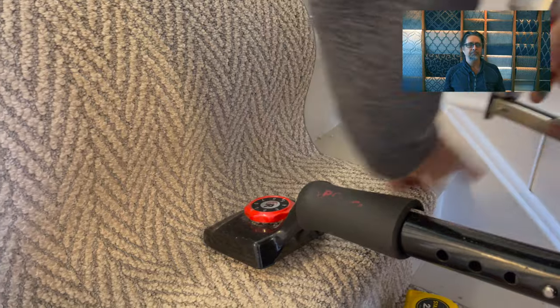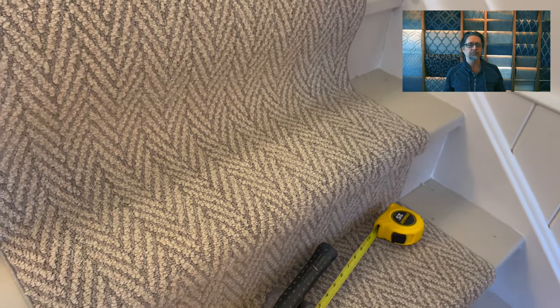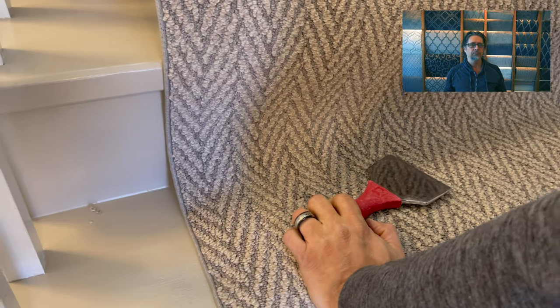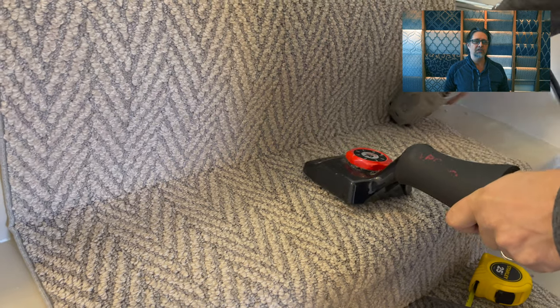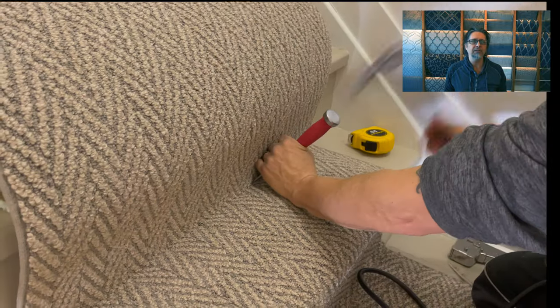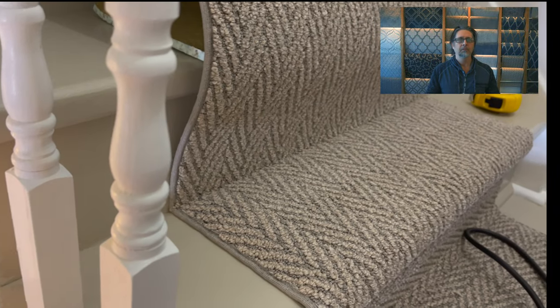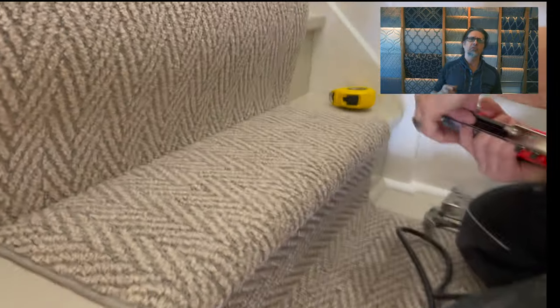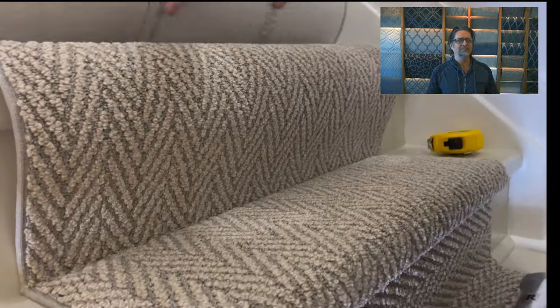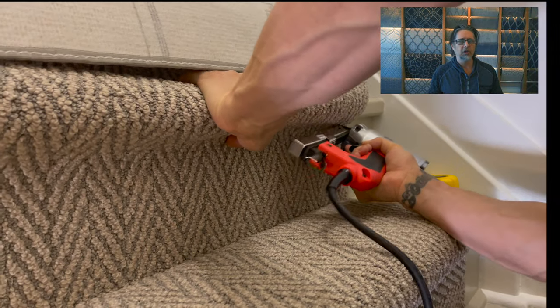Locking into the sides, then scoring with our tucker six times, pulling pressure, then stapling on the 45 all the way down every inch or two. Tucker and hammer to make that line look really professional. For anyone wondering, we're using five-sixteenths staples with a nine-sixteenths crown.